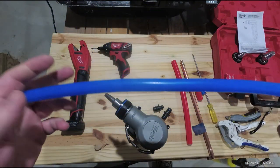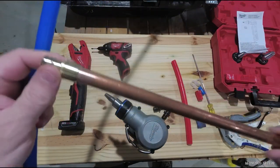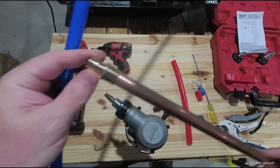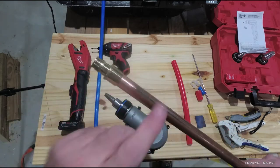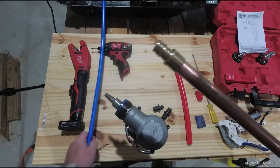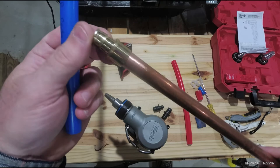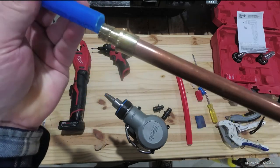There are three popular kinds of plumbing. You've got copper, which is the old standard and pretty much takes a professional — it has to be sweated together with solder and heat. Anybody could do it but it really takes practice and you've got to be clean with your joints. The nice thing is you can get a fitting that you sweat onto the copper and it will actually adapt to this Pex. If you've got old plumbing and just want to do some runs with this Pex tubing and tee into it, you can use these sweat-on fittings.